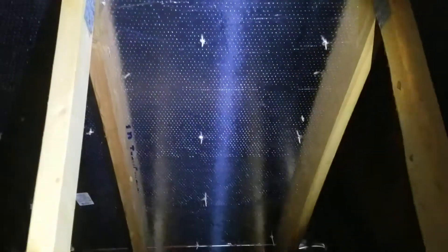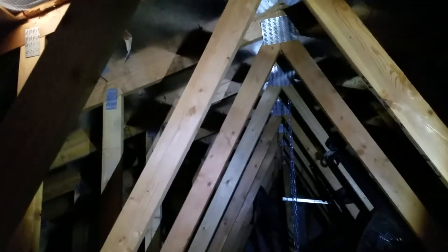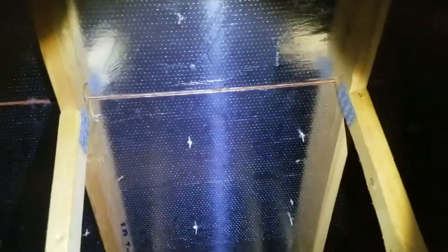So this is an attempt to block the heat from getting in here. Unfortunately, it's about 110 to 115 degrees in here. So there's a lot of problems with this scenario. This is basically creating a solar oven in their attic — by trapping the heat in here, you're not allowing the heat to escape. You're reflecting it and keeping it in this attic.